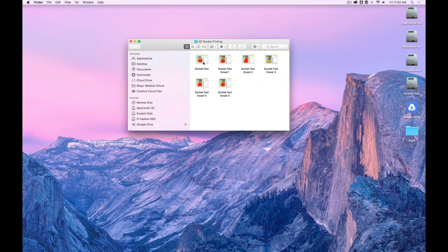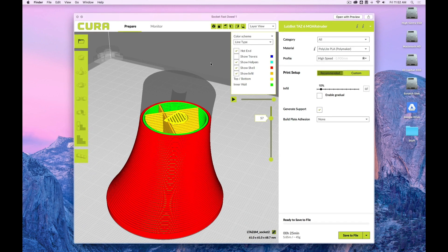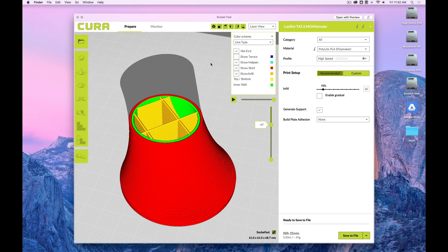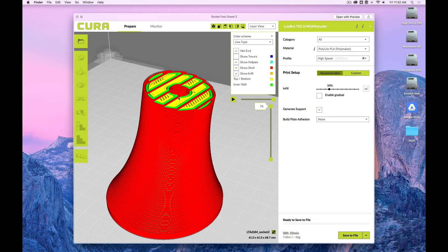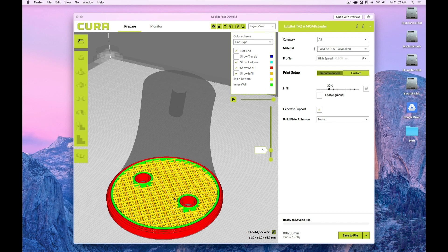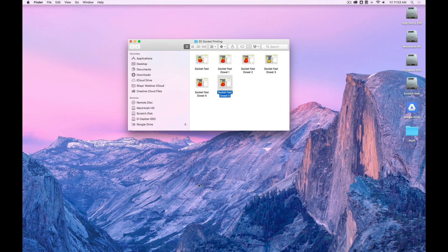Let's take a look at the sockets. Here's a 3D printed part for the socket. This is all done in Cura — I printed those with various resolutions. These were hollow with no openings, so you can see the infill is actually 15%. When I wanted to have holes placed in, this part has nothing below, so it will properly fall down, but this is what I want. So I needed to increase the infill to 30%, and you see how this is nicely gridded up, so that the part for the hole actually has something to sit on.